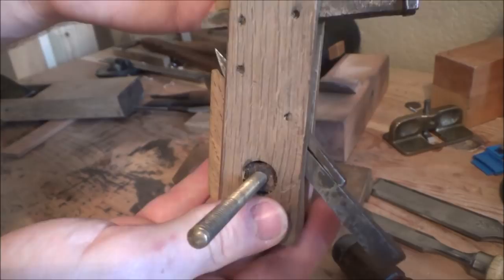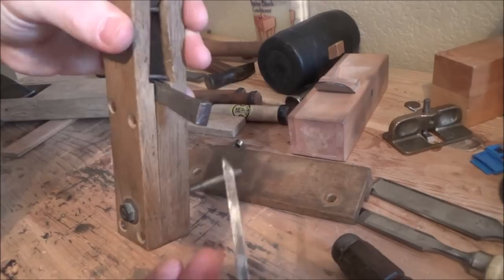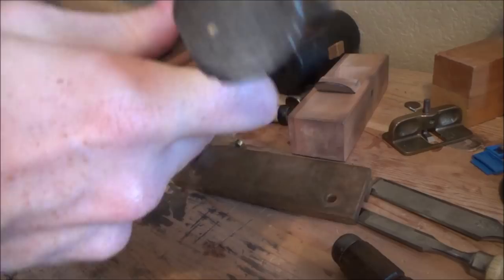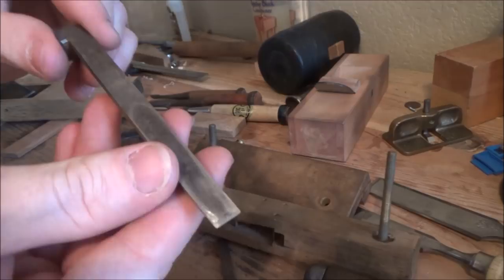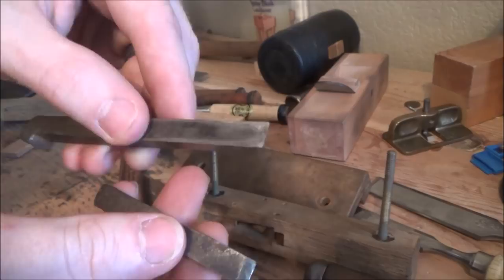Taking the blades out of this won't be too hard either. It's got these little curls over it, and technically I think they did this so that you can hammer these down where they need to be. The two blades come out pretty much like so. This has a little chip breaker on it, so this may not come out so easy — a couple of friendly taps with a local encouragement device. The blade is essentially a modified chisel, so you've got a little ura back here. They're actually in pretty good shape; I might not have to do too much work to them.